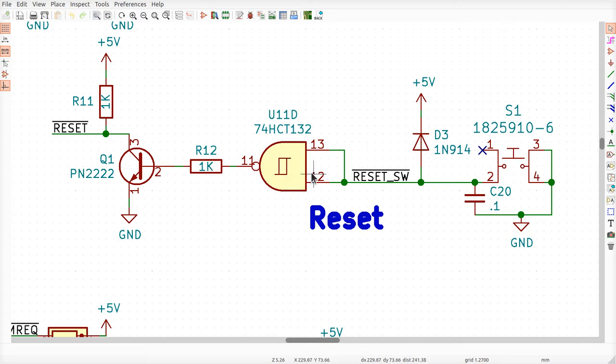And if you put a regular gate here, what will happen is as this thing charges up with these little saw teeth in here, the output of this gate will go on, off really fast and drive everything nuts downstream of this thing, okay? Now, if you rummage through the manual, the Z80 actually has some hysteresis on its own reset input, and it even recommends that you can, if you want to, just put a capacitor and a resistor on the reset line and forego all this other malarkey over here, and the Z80 will be fine, okay?